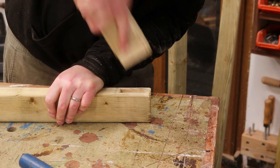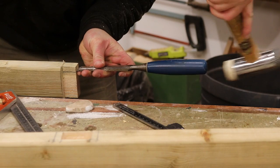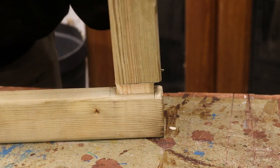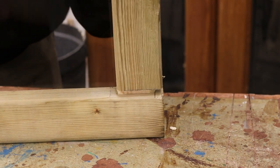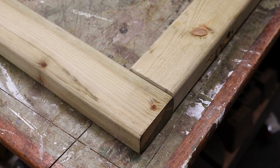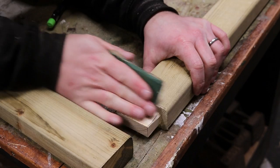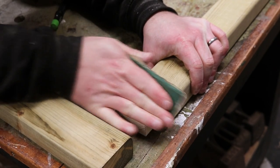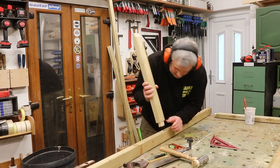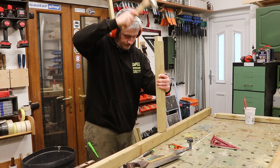Once I've got a good fit I just need to remove a bit more to complete the shoulders. As this material has rounded edges I decided to add a roundover to the end of my rails too, which I think looks nicer than a square edge butted against a rounded one. And I just did that with some 80-grit sandpaper. The rail in the middle needs shoulders on both sides as opposed to just one side like I chose to do with the top and bottom rails, and I got that fitting nicely too.